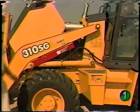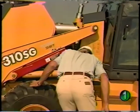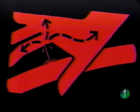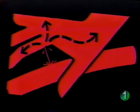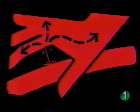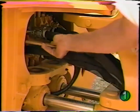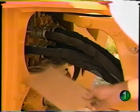Also look for hydraulic leaks, frayed hoses, damaged tubes, missing clamps, or rubbing hoses. A special warning about searching for high-pressure leaks: escaping fluid under pressure can penetrate the skin, causing serious injury if not treated immediately by a qualified physician. Search for leaks with a piece of cardboard. If an accident occurs, see a doctor who knows how to treat such injuries immediately.